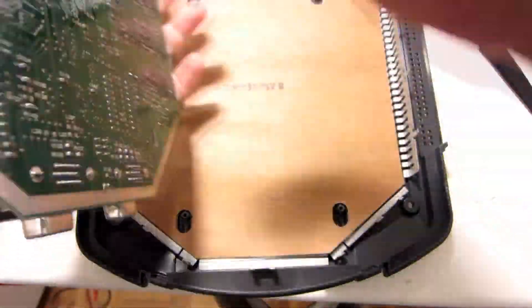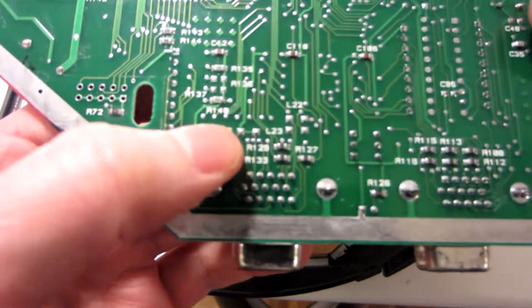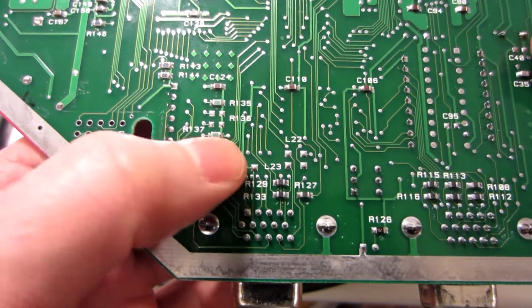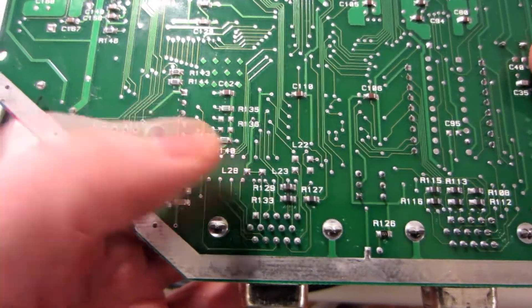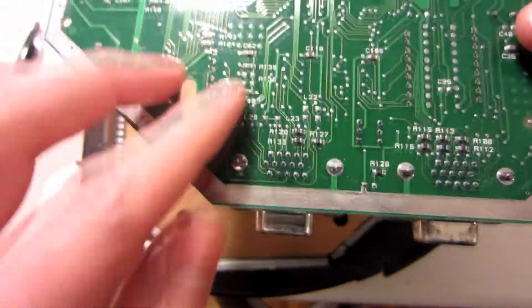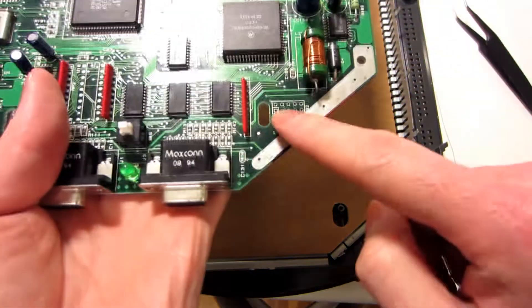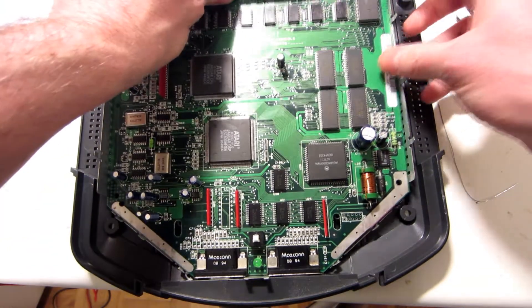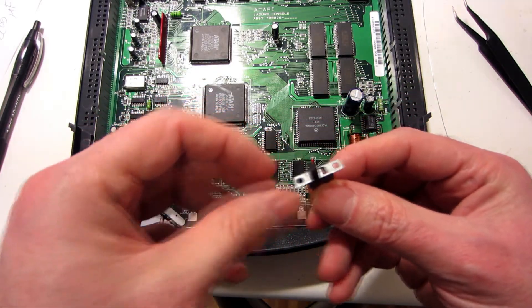While I'm at it, if you have a PAL console like this one, you can mod it to run at 60Hz. Right now it's running at 50Hz, and this is because of this resistor — the R140 — which is 0 ohm, making a link to ground and setting the console for 50Hz. You just have to remove this resistor and the console will run at 60Hz. You put two wires here and then pass them through this hole. Be careful to leave enough clearance around your cables to still be able to put the screw down and close your console.